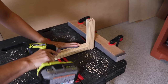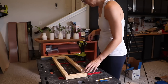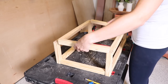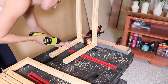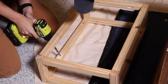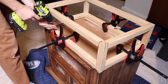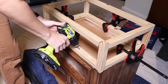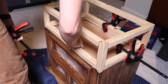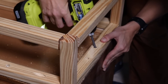With only one pocket hole per piece, it was pretty difficult to get things going — the first boxes were definitely the hardest. When I'm trying new techniques like building a brand new base I've never attempted before, I like to do it on smaller projects like nightstands first to see if it's feasible for a larger dresser down the road. It turned out the way I wanted, but it wasn't a fun experience. I was doing a lot of things wrong — I should not have put the top on before drilling the attachment holes on the bottom. I clamped the base to the dresser and used screws to attach it. I don't have a real step-by-step for you because I definitely need to make tweaks before trying this again, but since this was the challenge, I definitely challenged myself.